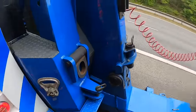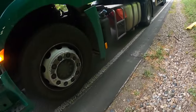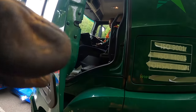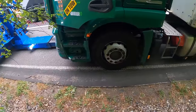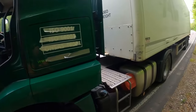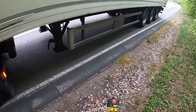Yeah, so unfortunately I have to take the half shaft off the offside on these Mercs, but we're not going to do it then. Drop it down a little bit because you find the cab will lift up a little bit. Okay, can you take the handbrake off slowly for us? That sounds good. Right, let's give it a little thing forward. As it might be the trailer brake, I just checked your stop button. Yeah, it might have lost air from the trailer, so the stop button, which is here, give that a... There we go. That's what activated that.